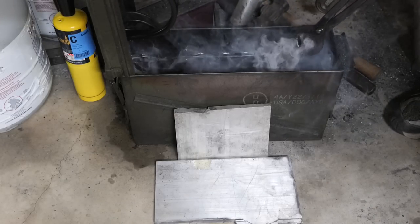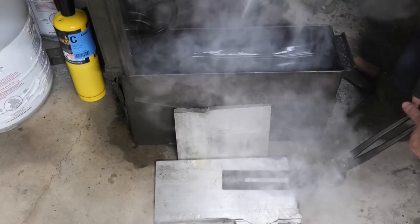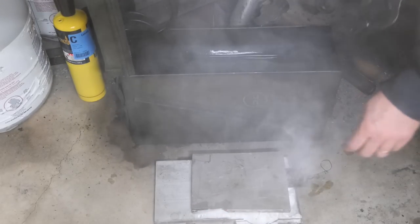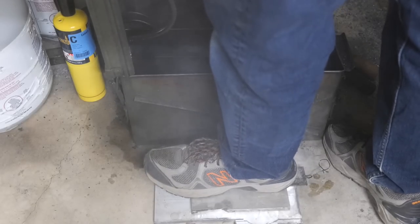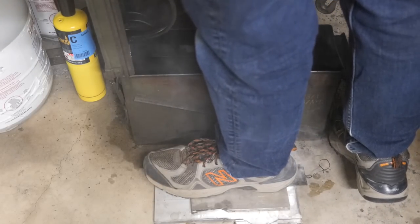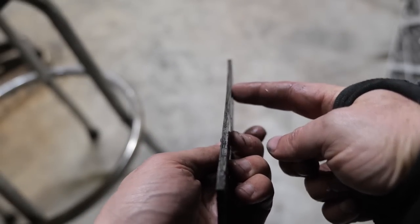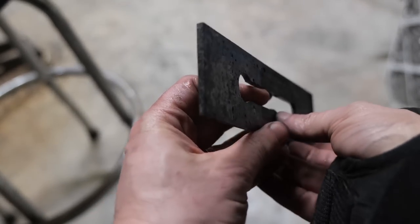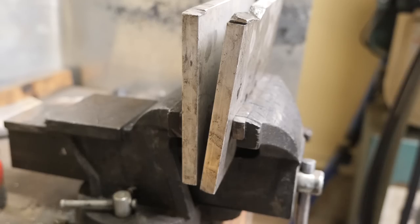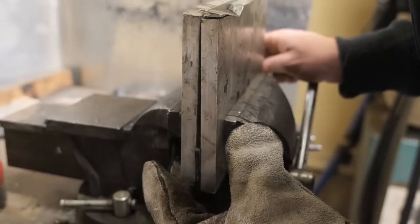I'm going to take this right out of the oil and throw it between these two aluminum plates and press it to help keep it straight — we don't want any warps. Unfortunately there's going to be a part hanging out the back when I apply pressure, and that part did warp. So I had to redo everything — go back, put it in the forge, straighten it, re-normalize it, and then try a different method for keeping it straight after the quench. This worked a lot better. I probably should have started here.